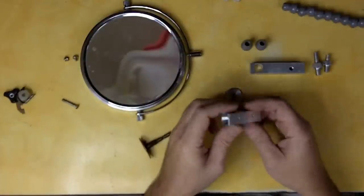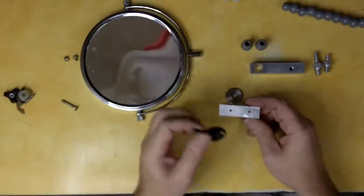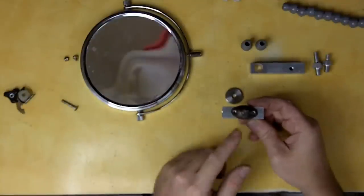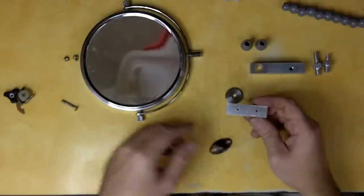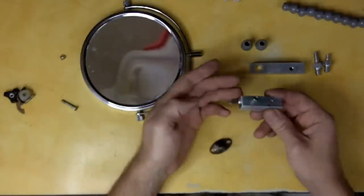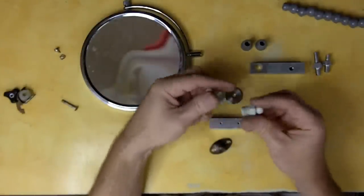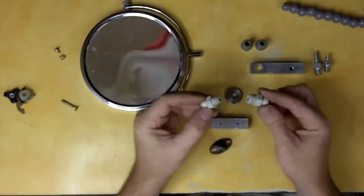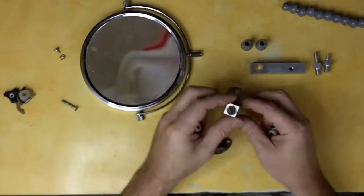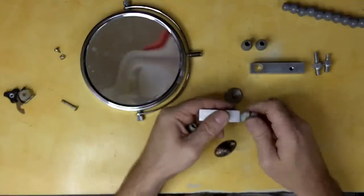What I did is I took a piece of 5/8 square aluminum, and right here and here I've pierced and tapped two holes to hold this mounting bracket, and I'm just using hard drive screws out of a computer to hold this on. In each end, because it came with these two fittings that were different sizes, and these are both pipe threads, by the way, I made appropriate threads on either end of this for those. So I'll go ahead and put these in here real quick.